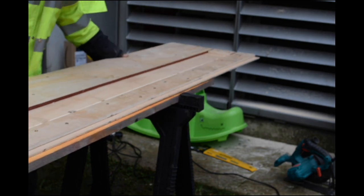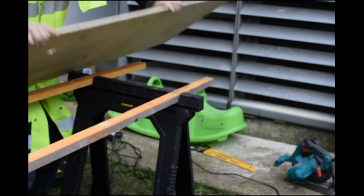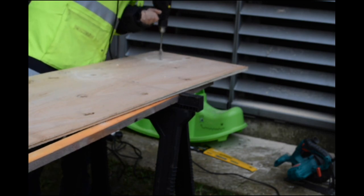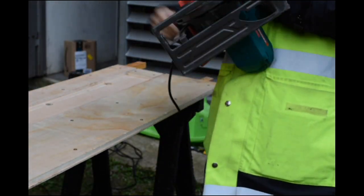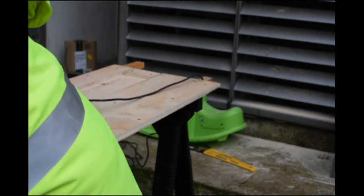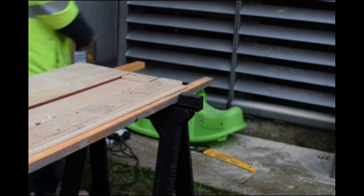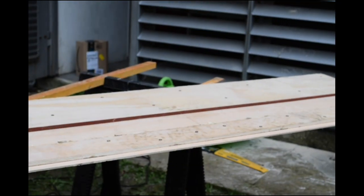I'm using what I think is called a spade bit. You drill just a little bit on the top and then turn it over and complete it from underneath - that reduces tear-out. My drilling skills are obviously very poor because I did get quite a lot of tear-out, but it's still extremely functional. Once that's done you run the circular saw through and that gives you the proper cut. In my next video you'll see it get used.